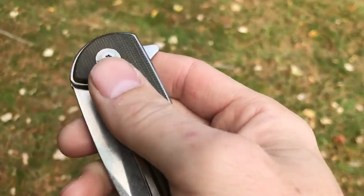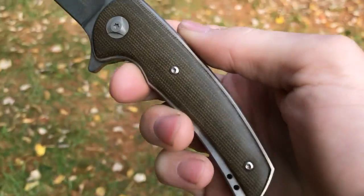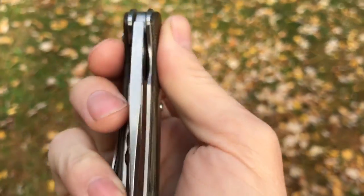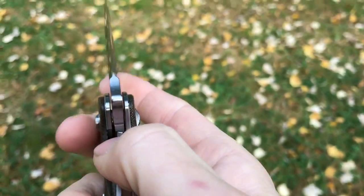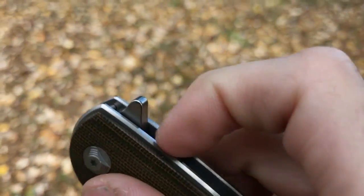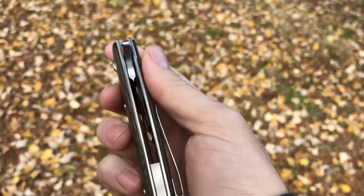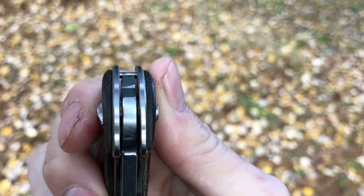This whole knife is a fairly thick package. The handles are four and a quarter inches long, giving us about seven point three inches overall. It's a titanium liner lock — the lock-up is a little later than factory because I bent the lock bar in a bit to give it stronger detent, as the detent was a little soft for my preference. We have titanium liners with green canvas micarta overlays, which are fairly thick themselves, so this is definitely not a skinny knife.